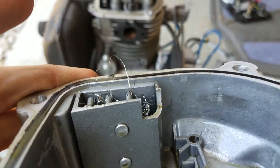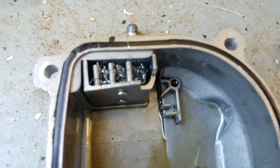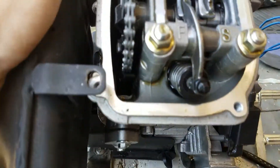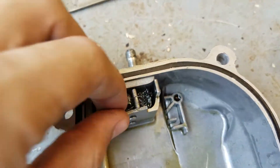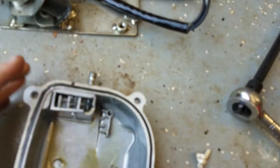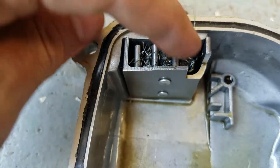I don't know why they would do that. I understand them trying to put a filter in there so oil wouldn't come out of this breather, but just metal shavings like this — they're not even held in there hardly at all. You can see the metal shavings just kind of hanging out. It wouldn't take nothing for one of those shavings to fall off into the crankcase and go down to the bottom where the crankshaft is and score things up, damage bearings, really screw stuff up. I see that as a horrible design — it looks like machine milling shavings from their mill machine. There are little locking pins to try to keep it in there, but as you can see it doesn't really stay.